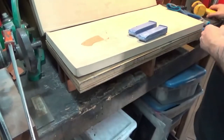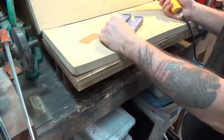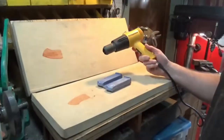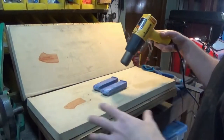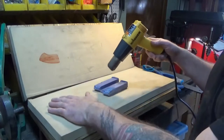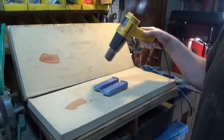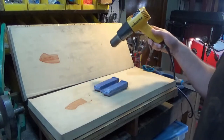While that's happening, I'll flip you over here. All right, while that's happening, this is my press. I'm taking my heat gun and I'm heating up all the rubber, and I'm also heating up my mold. All right, so just constantly going back and forth, making sure that everything is good to go. And you don't want this to be cool, you want it to be warm. You want everything to be warm so it's nice and pliable, and then when I crush it or compress it, it makes a nice fit, a nice mold. All right, so I'm just gonna do this for a bit, keep flipping over the Kydex, making sure it's good to go, and then I'll put it in the press.